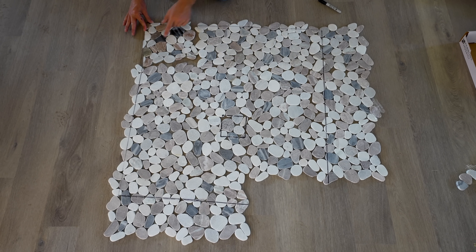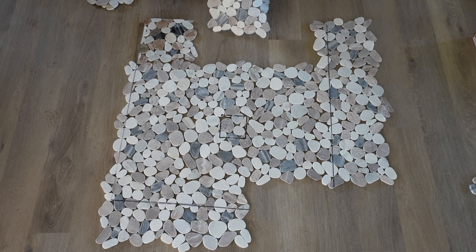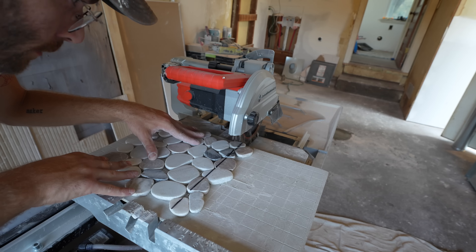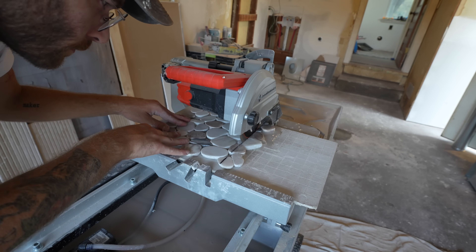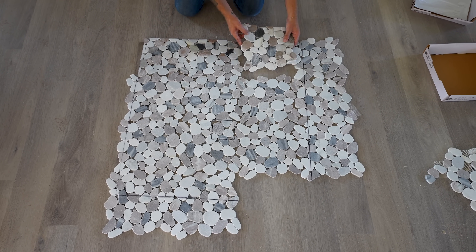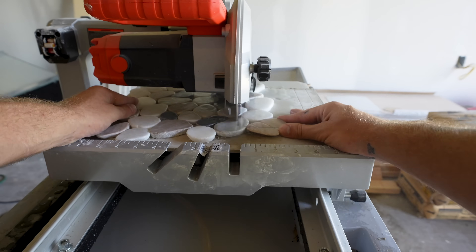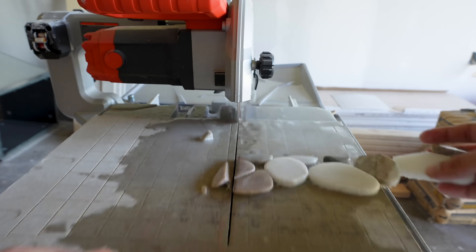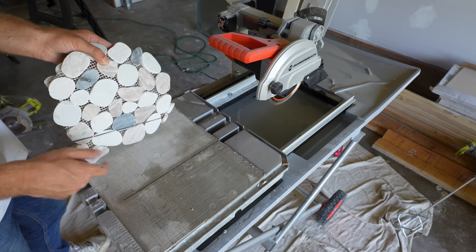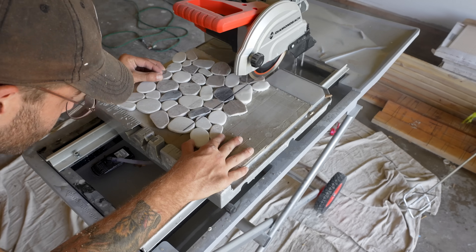Now that these stones are wet you can see some of that color really start to pop — that's awesome. These next two pieces just need one edge cut and I'm using some cement board as basically a zero-clearance insert like on a table saw. This material is no problem for the diamond disc to cut, and now all the tile underneath is supported, even the small pieces on the edges. Another huge upside of having this backer board is a reference line for lining up your mosaic tile, which is really convenient especially on these free-form cuts where we're not referencing a straight edge.